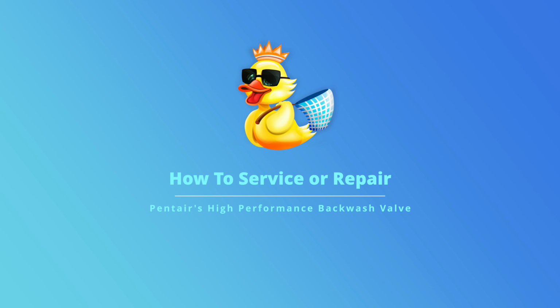So there's a couple reasons this happens. First one is the plastic is brittle. Eventually it just breaks over time from being in the sun. And then number two reason why this would happen is in this valve here, there's some valves that turn inside here to dictate filter backwash mode, and sometimes those get gummed up through time from pool chemicals and water and all that. So what I'm gonna do is take this apart, show you what to lube up, and replace this handle so we can start backwashing this again in the future. So stay tuned for that.